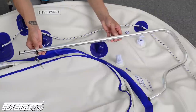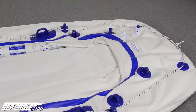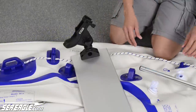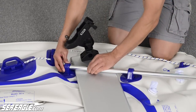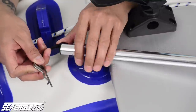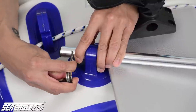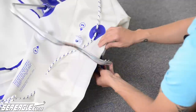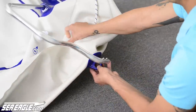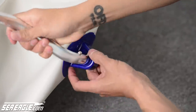Remove the pin from the straight side of the bar. If you have the Sea Eagle Fish and Troll, place it in between the motor mount grommets at the rear of the boat. Insert the straight side of the bar through the rear grommet, over the fishing troll board and back through the front grommet. Reattach the pin's tether. Insert the pin in place, going from the inside of the boat to the outside. Take the remaining end, flip up the rear of the boat, and locate the grommet on the underside. Insert it through the grommet and the push pins will lock it in place.